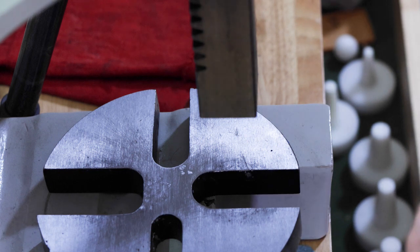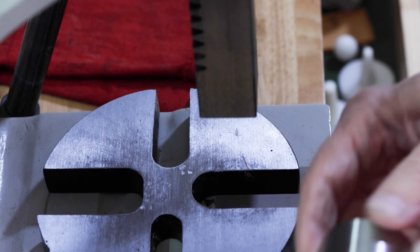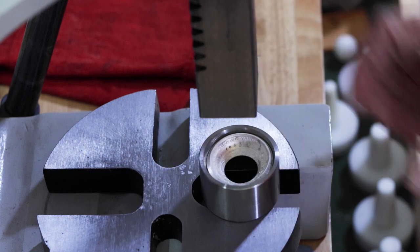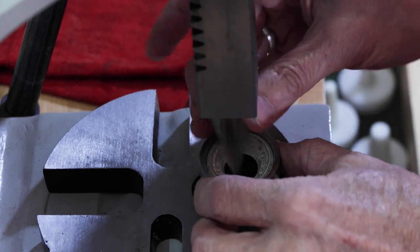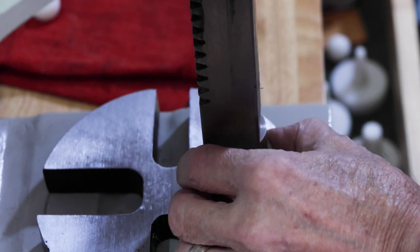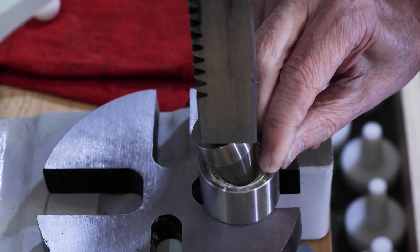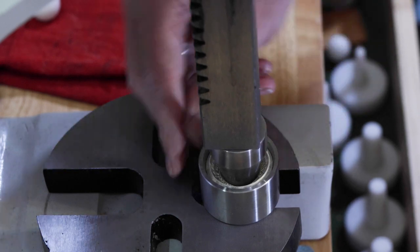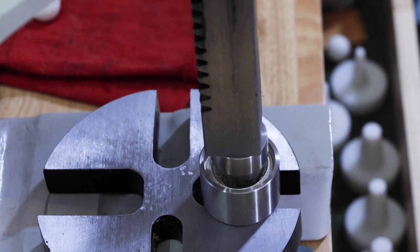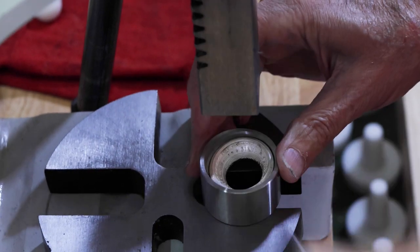So now we'll take a 17 degree reduction die, find the right one here. And this one ought to work, yep. And we'll continue folding. We're going to start with this stainless steel cone. And we'll go down about halfway, and then we'll switch over to composite. And again, let's make sure that we've got the coin in here level as possible. Okay, that looks pretty good. So we'll go down about halfway. So we don't want that cone to come in contact with all the detail, because it'll smash it a little bit.